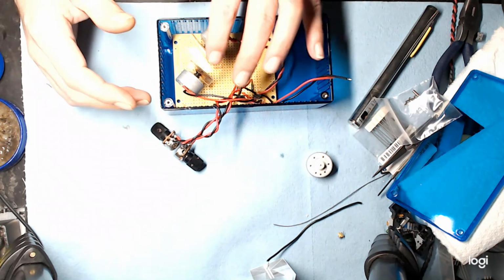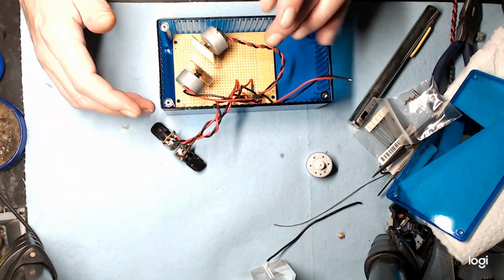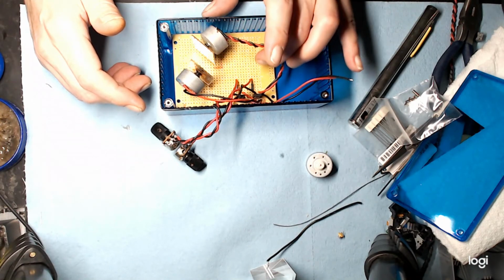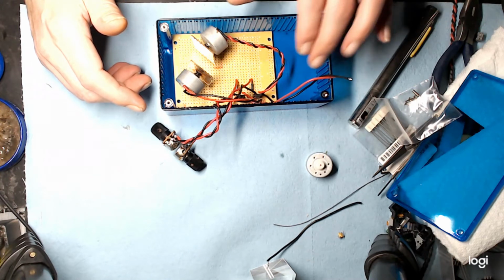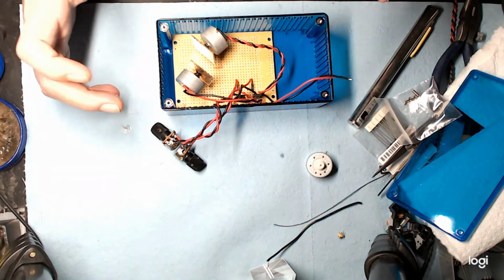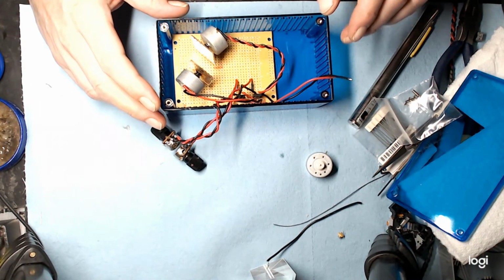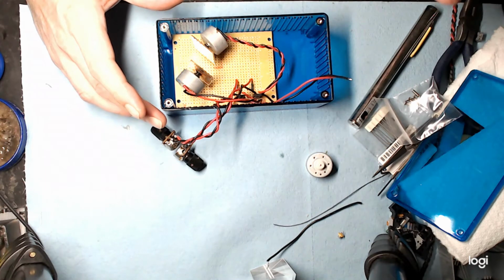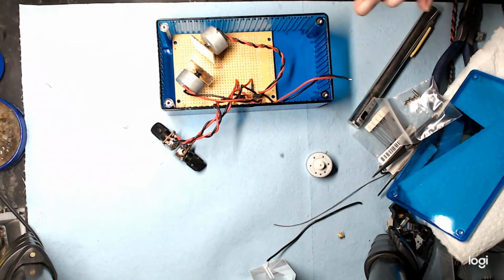Like, I want to add another beam to these. I want to add 2. So I've got limited space to do it because on this side it's going to be the battery. I'm going to make this a single cell lithium ion that'll power both the motors and the lasers, or laser, whichever. And I'm going to do it with a floating charge circuit, so you can plug it in, leave it plugged in, and the battery will stay not fully topped up, say around 3.9 volts, and that way you can just unplug it and the kids can play with it in the backyard, on the side of the house, or whichever, on larger surfaces. But so I need this room that's already back here. That's where my battery is going to go.